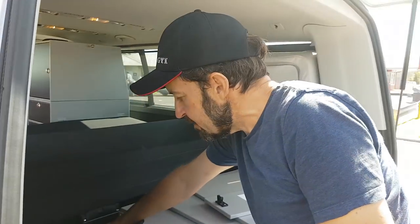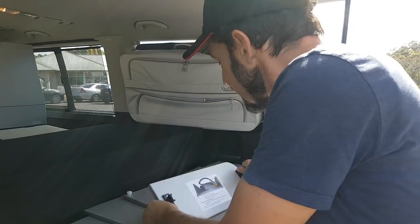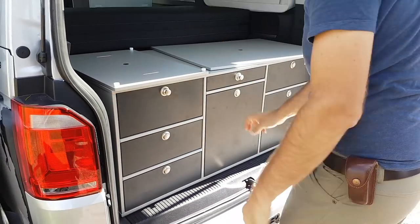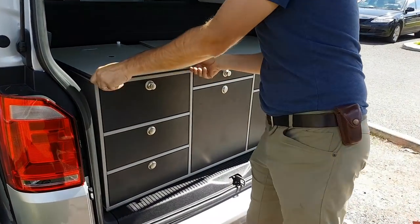Made in Germany — elegant. It's a 12-volt DC pump, 10 litres a minute at 0.5 bar. That was so quiet — I was just expecting to hear it. Beautiful. So we've got a 16-litre water tank, partly because that's what fits there and also because it's easy to carry in and out — people can generally lift 16 litres of water.